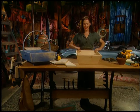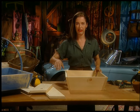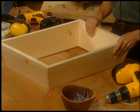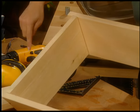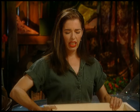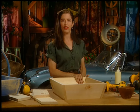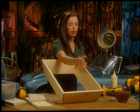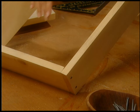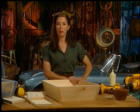I'm back to work on my garden trug. I've got three corners screwed together and I'm not quite so far along as I might be. And remember I was talking about how the angles don't quite work out - they don't want to quite be 90 degrees. See how this is folding in a little bit? So you kind of have to either cut it right, but why start now? So I just like to force the corners open a little bit. It opens the joint a little bit - it's three and three-quarter degrees. And if you were making something with thicker edges, you would really feel that right now, you'd feel the pinch of inaccuracy.